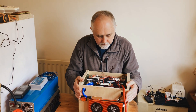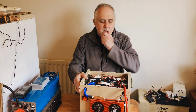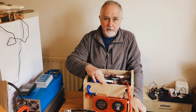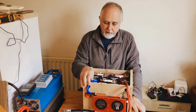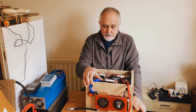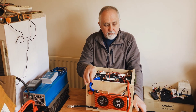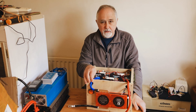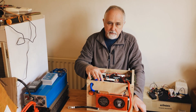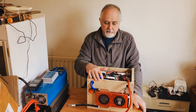The cells are rated at 300 amp hours. We had originally wanted to buy 280 amp hours but the supplier made clear they had none in stock and that they did have 300 amp hours for a slightly higher price, so we went for those. We top balanced them to 3.65 volts by connecting them in parallel.